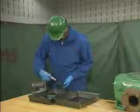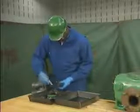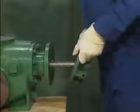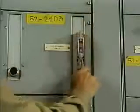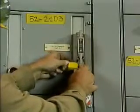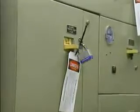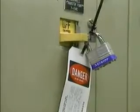In this topic, we watched a mechanic clean and inspect the components of a 2-screw rotary pump, and then we saw him reassemble the pump. Take some time now to try a couple of practice questions. Before any action is taken to remove or disassemble a pump, the pump must be locked out and tagged in accordance with your company's procedures. Lockout and tag-out procedures are designed to ensure that equipment cannot operate while it is being worked on.